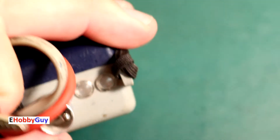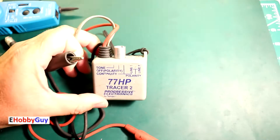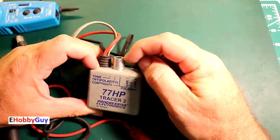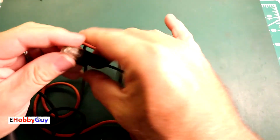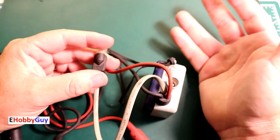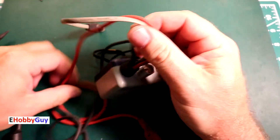I am not getting anything — I cannot really see too much as far as the LED is concerned. Flipping it into continuity mode, we should get a red light if these two clips touch. That is definitely not working — nothing is happening with continuity. That is not the major function I am most worried about; the greatest value is in the toning portion. It also has an RJ45 connector you could use for tracing network wiring.